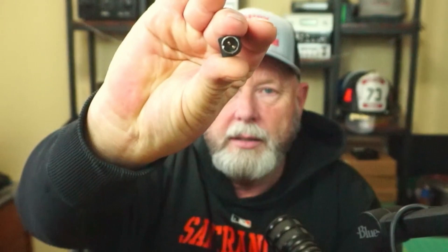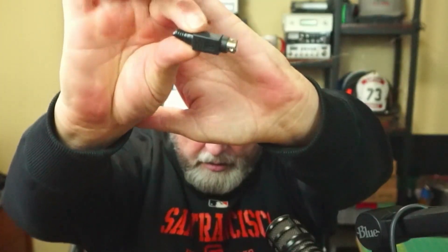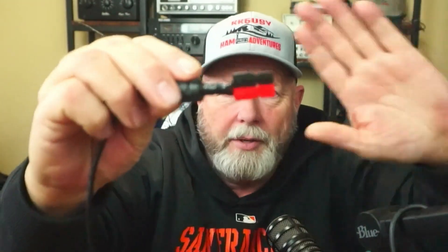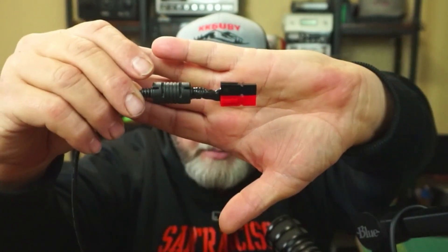The supply came with a barrel connector on the end, but what I did is put PowerPole connectors on it — PowerPoles are pretty much the standard for everything. There's also what looks like a little toroid on it. For something that powered a TV, I figured it's got to be fairly quiet. I actually plugged it in and it doesn't make any noise that I can see on the radio, though I wasn't hooked to an antenna. Both the 705 and the KX2 use barrel plugs but different sizes — mine already have PowerPoles, so that's why I chose to go with PowerPole.